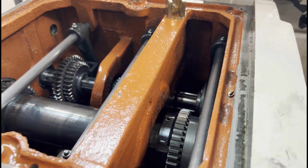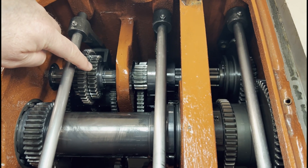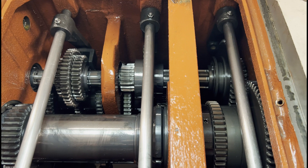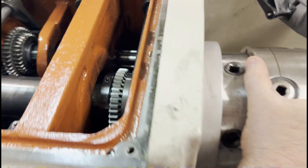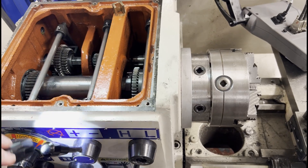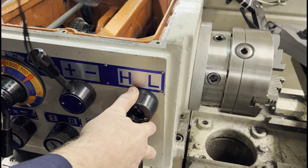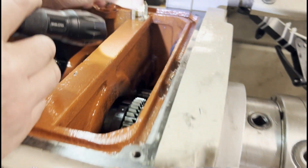The gears wouldn't engage into gear, and instead of turning the spindle to get movement in the chuck — or to get movement in the spindle to get the gears to engage — they forced with two hands and they overpowered the shifter fork and broke it off.